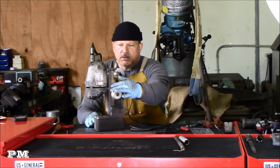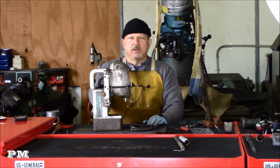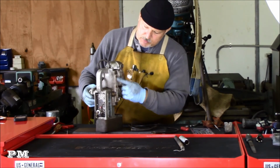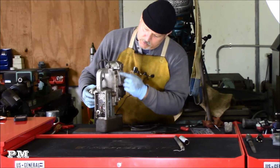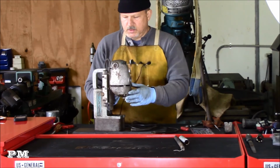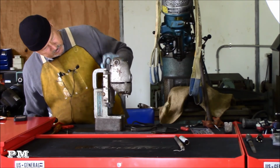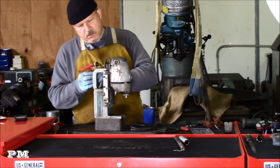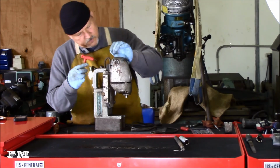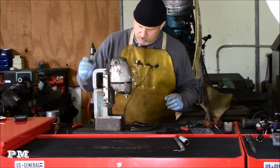On this side, you've got some screws that help keep everything aligned. Looks like some adjustment screws maybe here as well, so the gibs and all can be adjusted. But of course, all in all, that seems good and tight. It just needs lubricating and cleaning up. But these pieces here seem to be plastic. Seem to be hard plastic. The actual gibs, part of the dovetail assembly anyway.